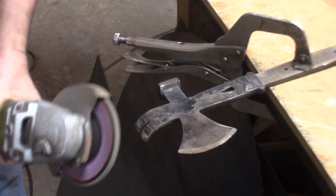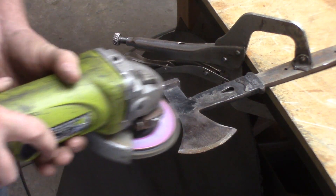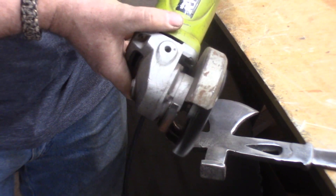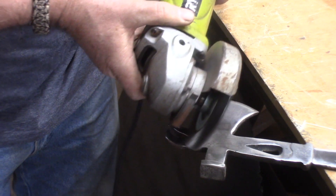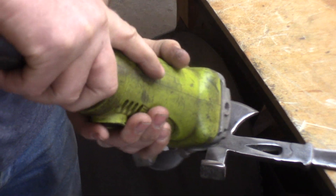The first thing I used was an 80-grit flap wheel. That seemed to take off the majority of the rust that was on there. To get into the little nooks and crannies, I decided to add the wire brush to my angle grinder so I could get in and take away any of the leftover stuff the flap wheel couldn't get.